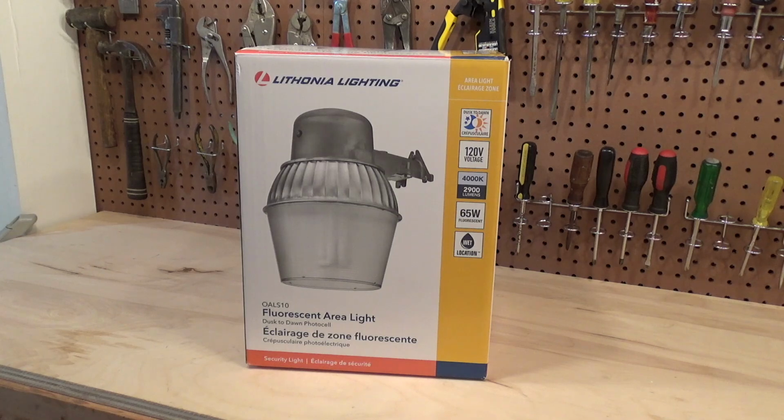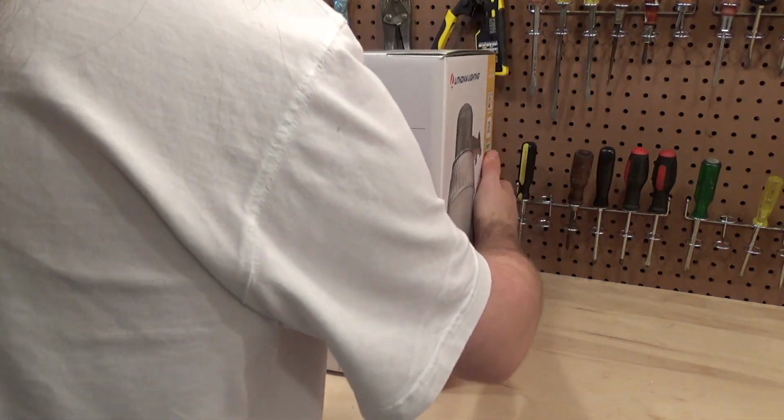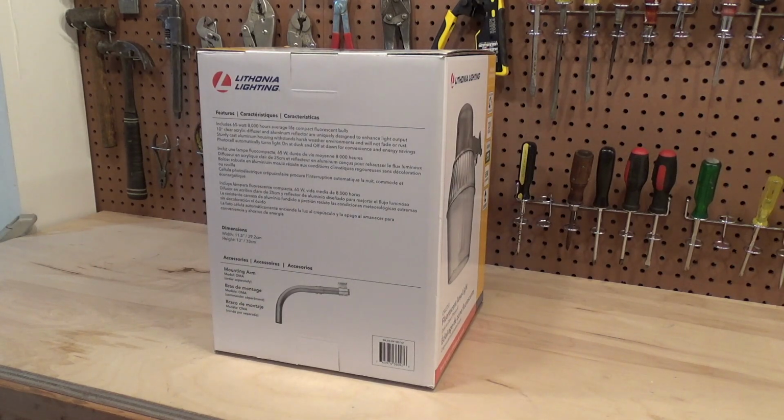And plus these are probably relatively instant on, so you're not having the warm-up time of a sodium or a metal halide. Now, down here I'm not sure it's really going to be the best application, because we're going to have frequent on and off cycling. Same thing with the garage. So I'm thinking maybe what I'll end up doing long term is install 2-stage lighting and have incandescent lights, turn it on and off if I just go in there to grab something, and then I'll have a second stage of lighting that can contain things like this, which are much brighter.